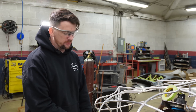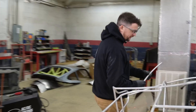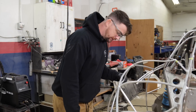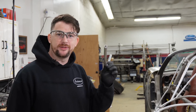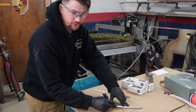Because this is just a simple arc on both sides and should be the same, I'm going to test the other side. If our math and fabrication skills were right, it should fit really well. It's perfect. I'm going to trace the outline of this tube on the table, and then I can just bend this twice and copy-paste it for both sides — that'll save a lot of time. This is the benefit of having a table with cardboard on it — you can just draw right onto it.